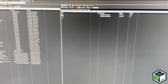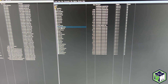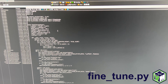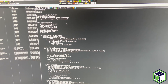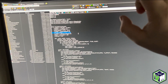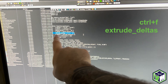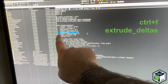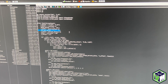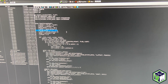I was already logged into WinSCP, so we're going to go to pi > klipper_screen > panels and we're looking for fine_tune.py. A great thing about WinSCP is I'm allowed to use the text editor and make changes without any issues whatsoever. What we're looking for is a thing called extrude_deltas. Not everybody's Klipper Screen looks the same — just ctrl+F and type in extrude_deltas. You can change that to 5 and 10 to start, then reprint a part and do 1 and 2, or 1 and 4, whatever, until you get exactly what you need.